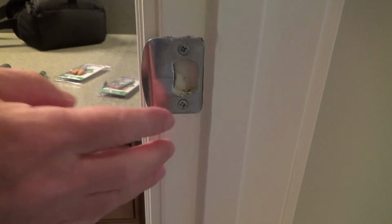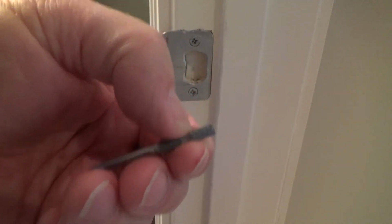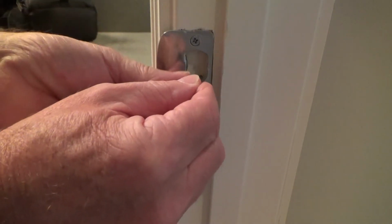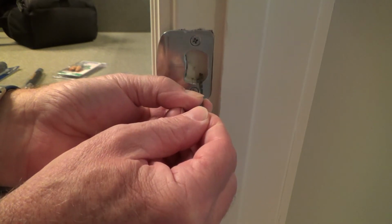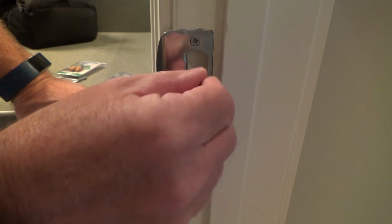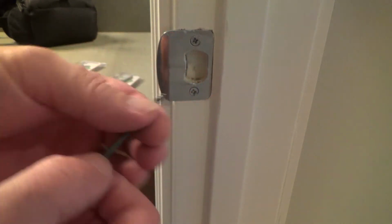The other thing I've done before is I've taken just a regular standard drill bit, and I don't think I'm going to do it on this one, because I have this other nasty little rasp thing that I'm going to use that I've already eaten into. But you could take a small drill bit like this, and you could use that in your drill. Now it chatters a lot, so what I'll usually do is I'll drill it right into the wood back there, okay, and sink it in there a little bit. Then I've got something to just lower down and grind down, and I might have to use a bigger drill bit, and it's easy to break your drill bits off doing that, but you just sink it into the wood. You don't want it up too high. You want it a little straight or just a little bit below level. Then you can use that, and then you just grind that down. I've done that. It works pretty good using the side of your drill for a cutter.